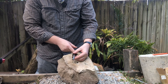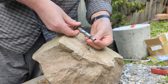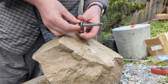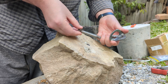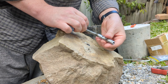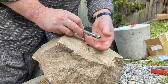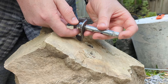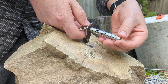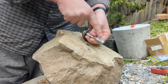Like any mechanical anchor or anything threaded, they can actually come loose. If you're not familiar with how these work, I'll just disassemble it. We have the little nut at the inside, which is cone wedge shaped, we have the sleeve, and we have the bolt - usually fully threaded. In this case that's a 10 millimeter hole. When you put the bolt in, the sleeve presses against the back of the hanger. You bash it in the hole and then tightening the bolt screws the nut down.